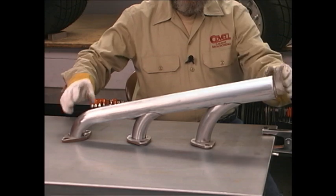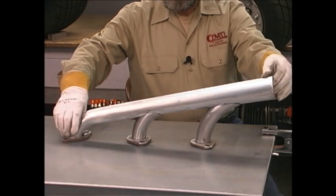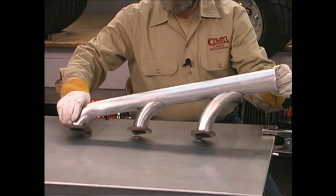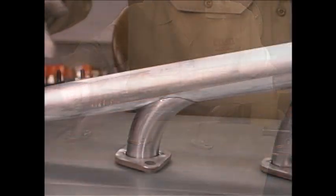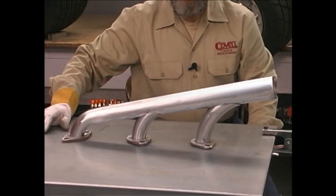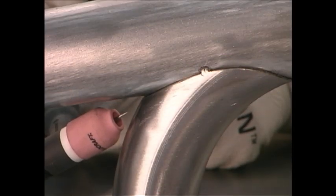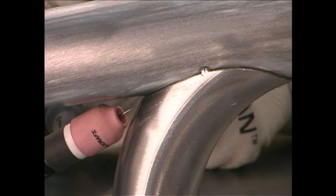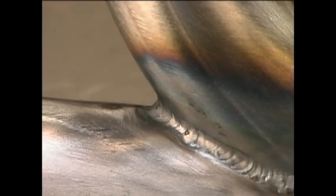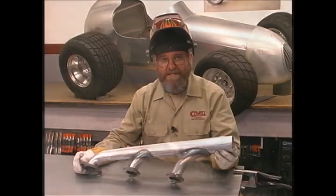Some of the most interesting and also the most demanding types of joints I've had to work on are those of tubing — complicated pieces of tubing that fit together. It's always a challenge to get a TIG torch into these tight little recessed areas, but it can be done. In situations like this, the gas lens is going to be your best friend. With the tungsten stuck out this far, we actually can get right into that little joint. This is the most difficult joint configuration you're likely to encounter, but with some practice you can probably do a very nice job.